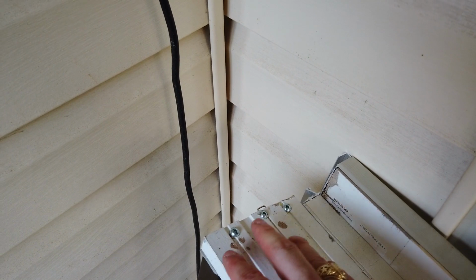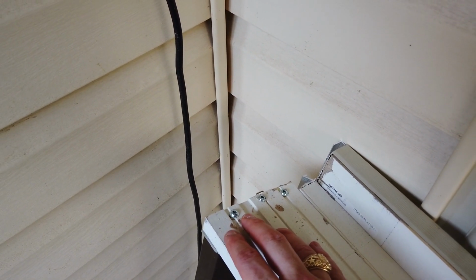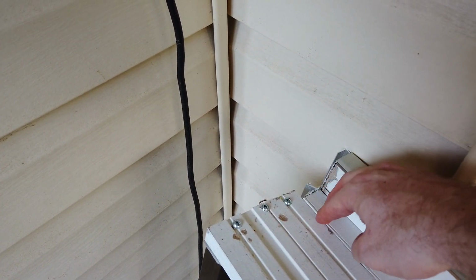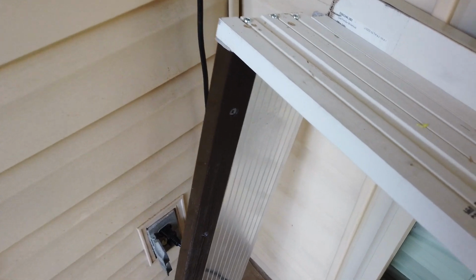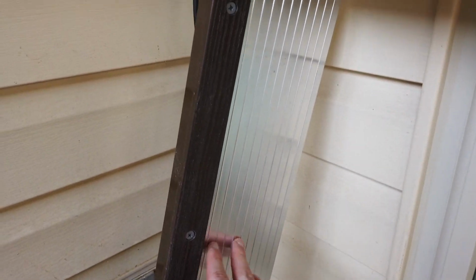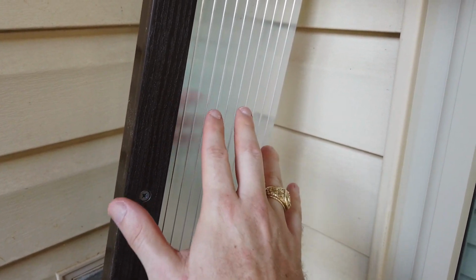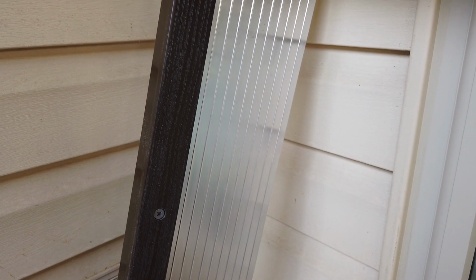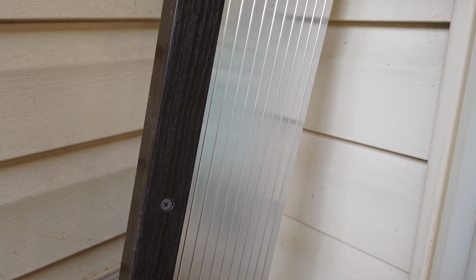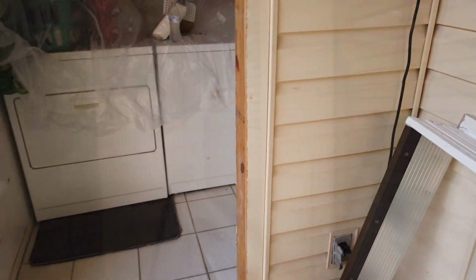A lot of the lower cost, or what would be referred to as builder grade vendors, they don't screw, they staple. And so over time those staples work loose, and then through repeated traffic walking over the threshold it kind of starts moving, and you can feel it when you walk over the threshold. So again, just another thing that sets ProVia apart from the competition, and the Brennan installation apart from the competition.